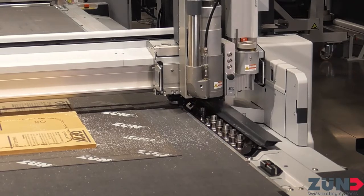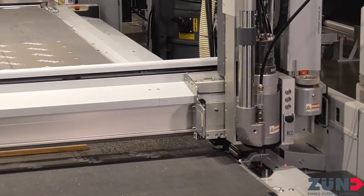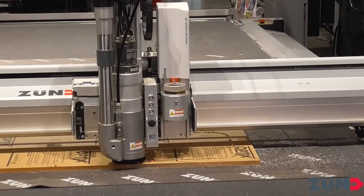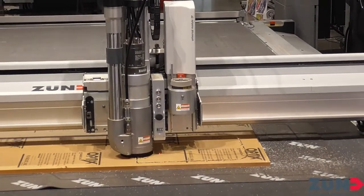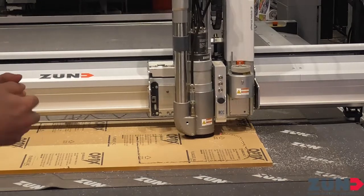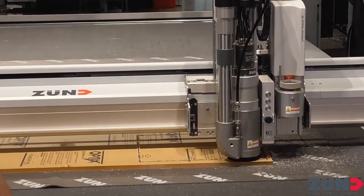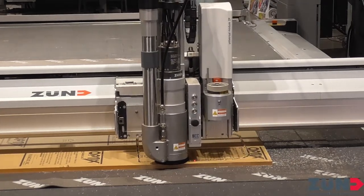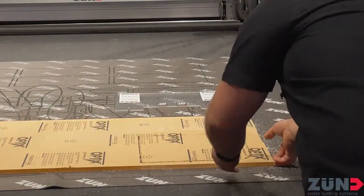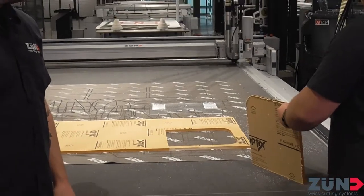Now we're changing to the polishing bit. We have two different polishing bits. This is the P201 — it has a synthetic diamond on it. The benefit is you can polish up to about 12 millimeters per pass. The other one is the P106 — it does a great job but you can't polish as much per pass, which is why I prefer the P201. The main difference between the two is the P106 can be resharpened, while this one once it dulls you have to replace it.